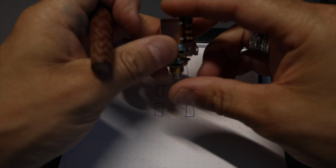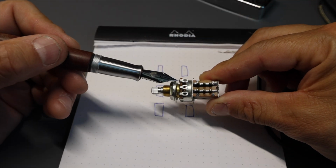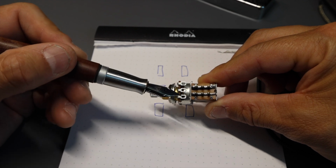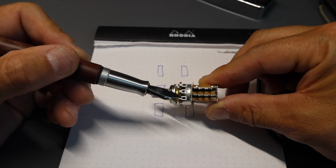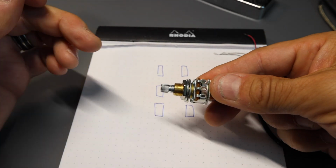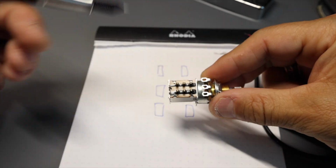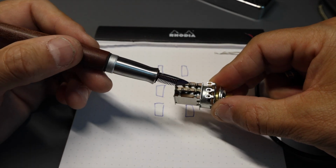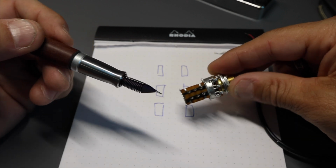When we look at the back of a push-pull pot, we've got our pot down here. So you see where we've got our three, this is like a normal volume pot, right? Or a normal tone potentiometer, right? So you've got your three, okay? So pretend that this wasn't even here. It would just be like a normal pot, right? Now, this top part is a switch. And you've got 6 things here, but it's not as confusing as it looks.